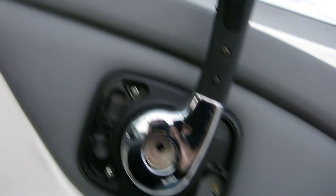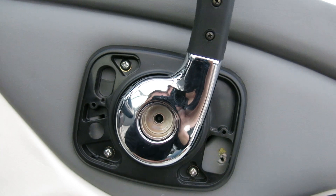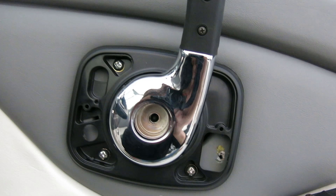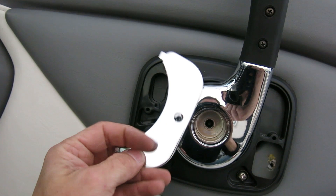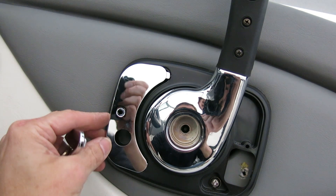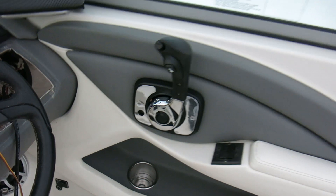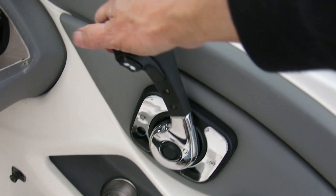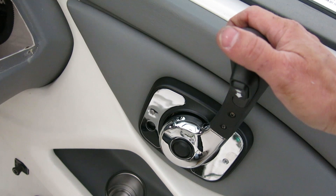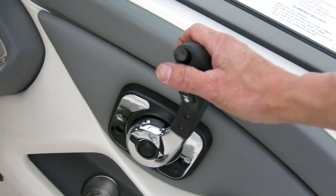Since I am not going to be using the kill switch and I don't have the external trailer adjustment, I'm just putting the panels on now. I'm actually going to try to get a second set of these that has no hole in it, because when they send them to you one has the hole for the kill switch which I'm not going to be using. But basically I'll button that up for now. There she is — all finished! At this point you'd want to go through the motions and make sure all your adjustments are set correctly: that you're getting full throttle, that everything's returning correctly, and that your shifting adjustment is done as well — especially in my case where I've changed the cable, you have to go back and double check those shifter adjustments on the out drive. But otherwise, this project is all done.